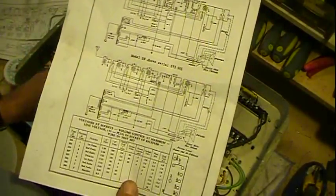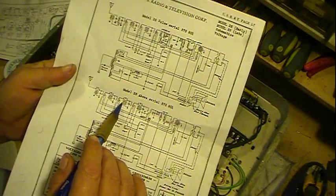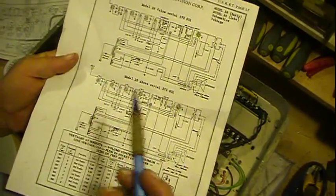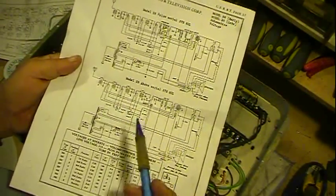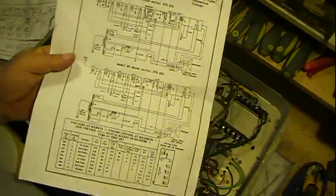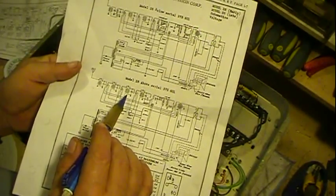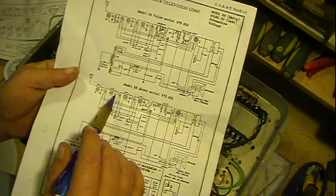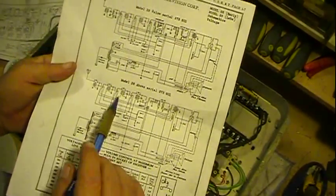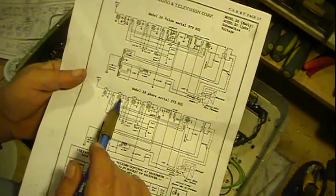But the main thing is these generally ran anywhere from, as far as a turns ratio between the two, 6-to-1 to 2-to-1. This radio actually runs the more, I don't want to say universal, but average. The average was 3-to-1, and that's what it's actually running, 3-to-1. And so 3 turns to every 1 turn on the secondary, 3 turns primaries. So it's actually stepping down. I'm within close proximity of that 3-to-1. I believe I'm running about 3.1 and 3.2-to-1 on the 2 that I rewound. So well within fine. It'll work just alright that way.